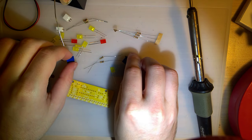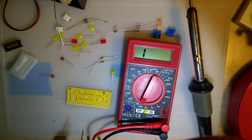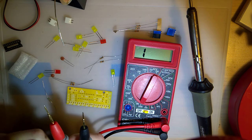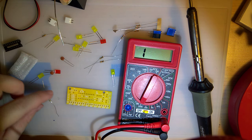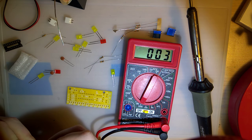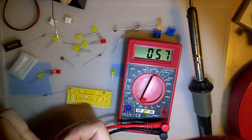You're going to drown it in solder because this is practically a new tip. I think I've used it once before I went ahead and retired this iron. This iron does not have temperature control — you just plug it in and hope everything works out for the best. Here's the first thing that's confusing: we have extra parts. So I guess let's start off with the resistors, because those are the smallest and I think they'll be the easiest to work around.